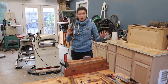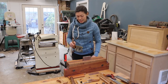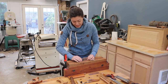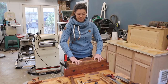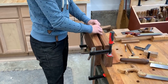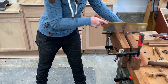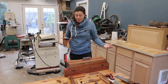I'm going to do this right-handed so we have that example as well. I want ideally to have my piece positioned so that I'm sawing at 90 degrees. The other really nice thing about the Moxon vise is that it supports so much of the workpiece — so much wood is in contact with wood — and so chattering becomes an issue of the past. I'm going to put my saw in the cut, take all the weight off the saw, and then just confidently saw forward. Once I'm assured that my saw cut is straight I can go ahead and saw away, and that's about all there is to it.